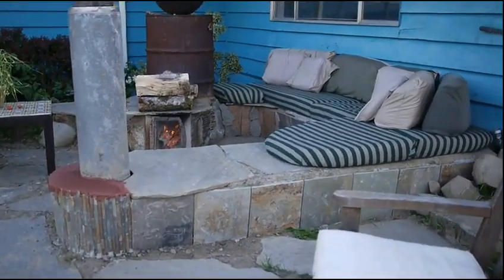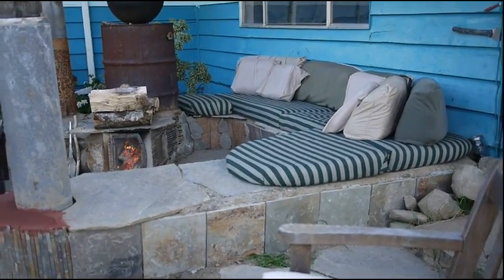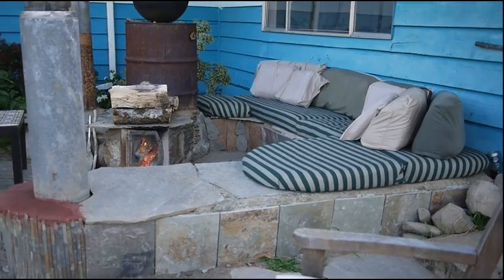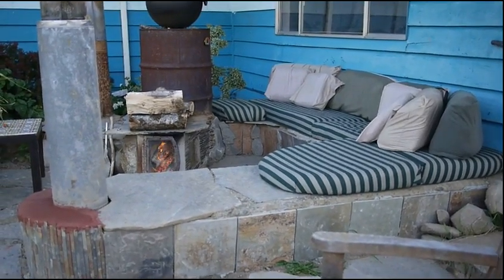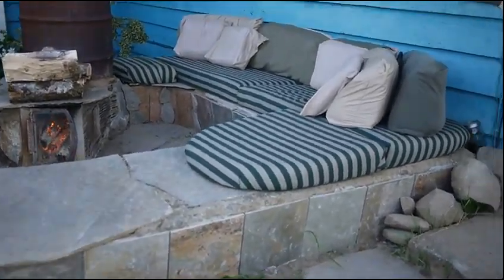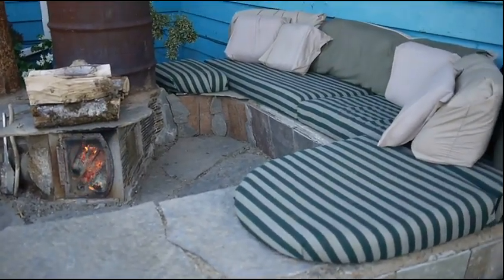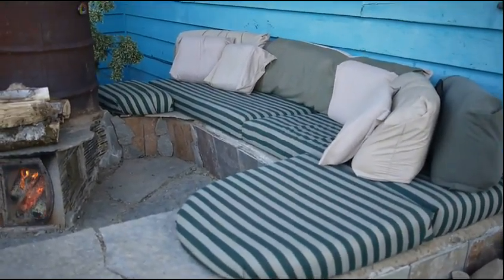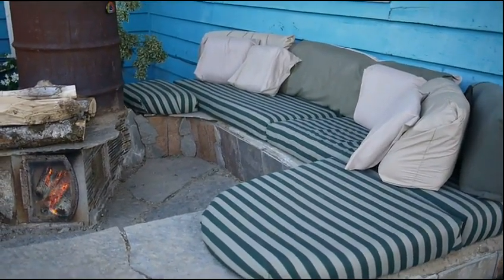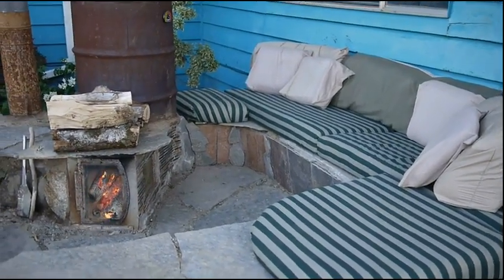I'm still really digging it for the outside setups. It just does such a good job of making a bench quick without really any expensive materials. In this case I boxed it in with backer board and tiled it. It's still a work in progress, but I'm pretty happy with that. You could do that with wood, stone, or cob, but they're just really neat, and they do heat up well and quickly. That makes me really fond of them for things where you don't want to sit around all day waiting for the bench to warm up, like an outside system when it's a surrogate fire pit.